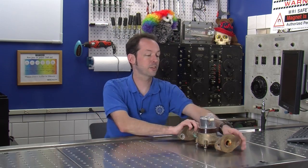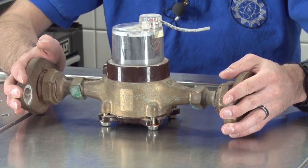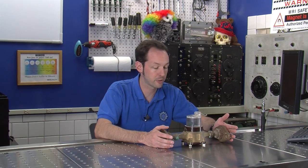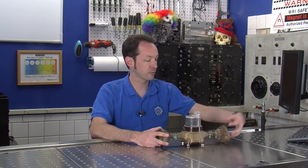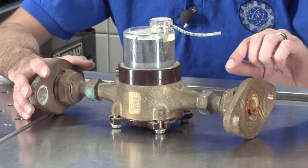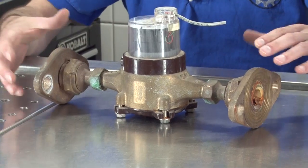This is the standard water meter that you're going to find around Grand Rapids and Western Michigan — it changes all over the United States, but this is pretty generic for around here. It hooks in-line; your water comes in from the city and this is a standard residential service. This is only a five-eighths inch water meter. Here at the lab we have a lot bigger — I think we have a two-inch water main here, but for a house you don't have as big.